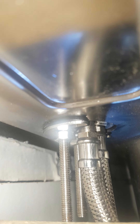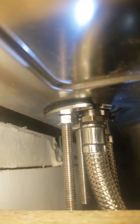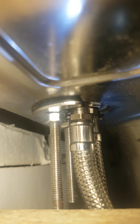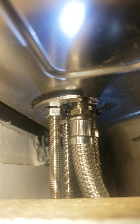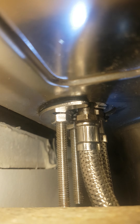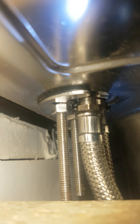That thing I found in the cupboard is probably meant for tightening that up. I'm not normally used to doing videos like this, but I thought I'd put it on YouTube for people that are stuck having issues with their sink tap wobbling. All it is is just tightening a couple of nuts onto a piece of metal shaped like a C, and all that does is push up towards the sink. If you've got more access than I've got — I've got a stupid piece of wood in front here — it's a bit harder, but I'm quite happy with the results. It's a lot tighter than before, and it saves asking the landlord to try and solve the problem.